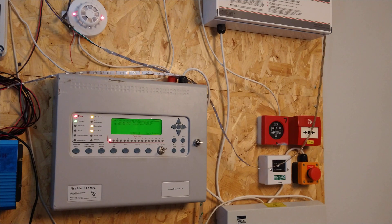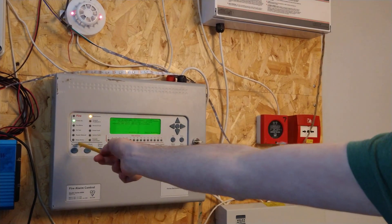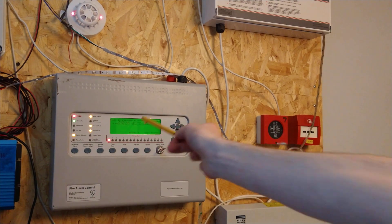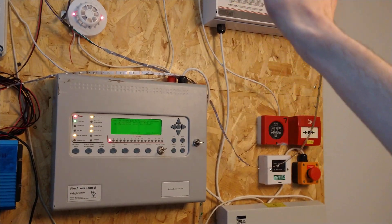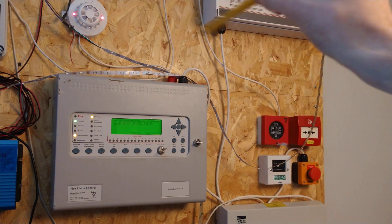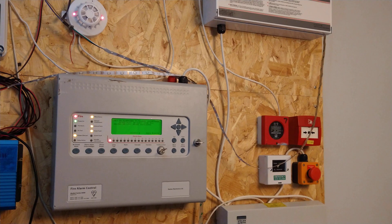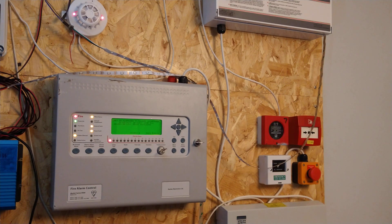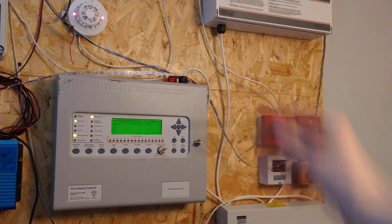You will need to re-learn — let me silence that. You will need to re-learn the device if you're changing. If you've only got one device on the loop, you'll need to re-learn that device using the menu. You also need to use the right enable switch to re-learn the device if you're just swapping it out for testing purposes.